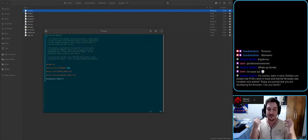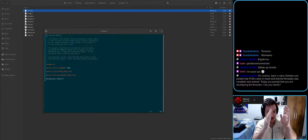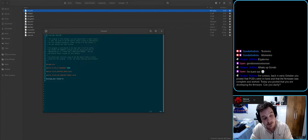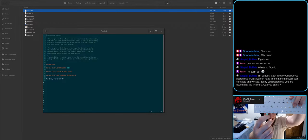Not that it didn't fit, it did fit. You didn't have enough clearance to get the connector inside the case. Since the connector was so short, the outside USB connector couldn't get in enough. On that PCB, firmware worked and was fine. This one is the 5th revision. This uses a much more complex and weird connector, a Wurth Elektronik connector, and it's lengthy as heck. You can see that it extends like 5 to 6 millimeters out.